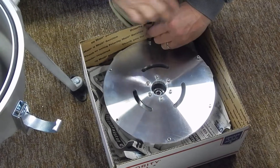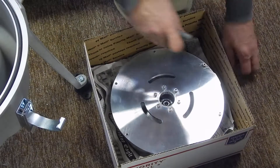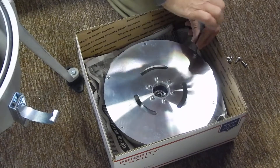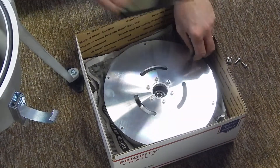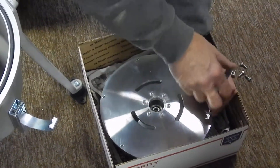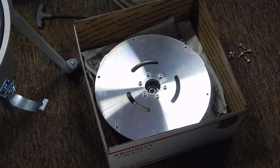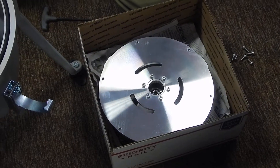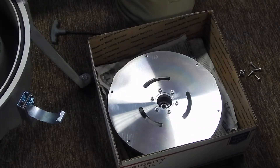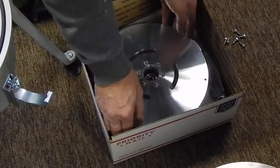After every tote of oil I clean the bowl. Honestly, I couldn't tell you how much you can run — the oil is always the variable. If you ask someone selling equipment how fast you can run and they tell you, you need to ask them: how do you know? You don't know how dirty my oil is or how much water is in it. Whether there's two or three percent or twenty percent water, it's not all going to be removed at the same speed — it doesn't work that way.